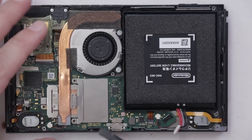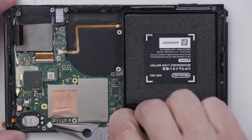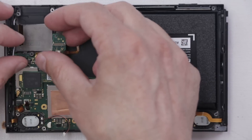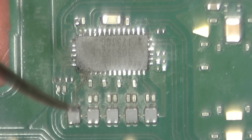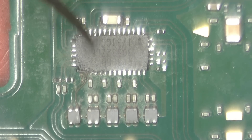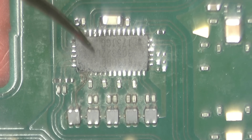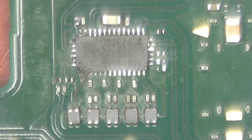Now I need to remove this motherboard so we can get down to the video chip. And here's the video chip - let's get zoomed in on that and see the damage. We have a number of issues. The first and most obvious is we are missing this trace. This trace right here that goes to the other side of this filter also is not connected to this chip. Also, this chip has not been soldered on properly - it looks like there probably wasn't enough heat used, and a number of these pins aren't connected to the pads. I need to check if we're missing some components over here, so I need to get a donor board. I'm going to assume that this P13 chip is good, but it is possible that the chip itself is faulty as well.